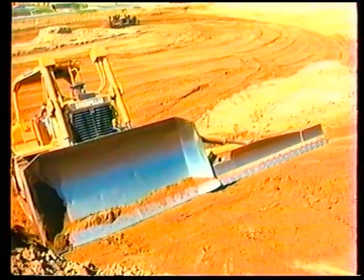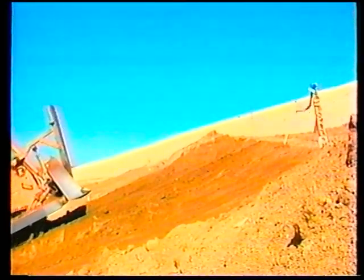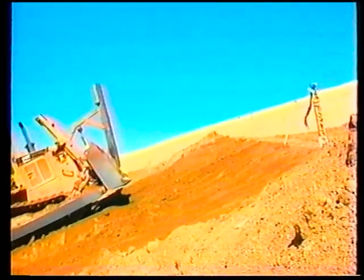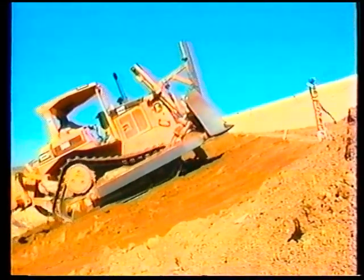It may be necessary to back drag areas of the slope that need cosmetic changes. To avoid the tracks from becoming clogged, keep the material on the slope moist but not wet. Track walk in the whole finished area of the slope. This will seal off the slope, hold in the moisture, and eliminate erosion. Continue this process across the entire slope.